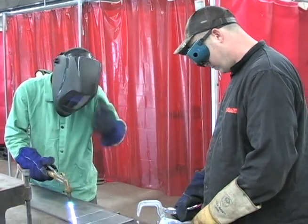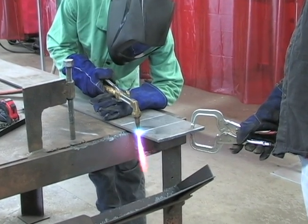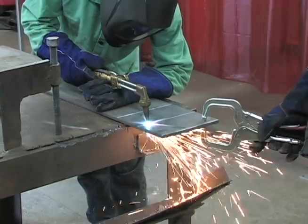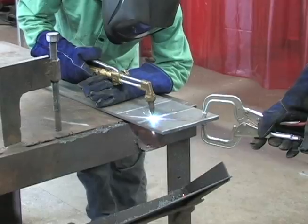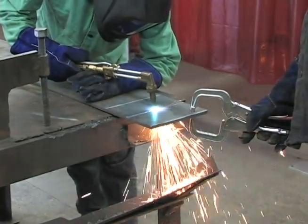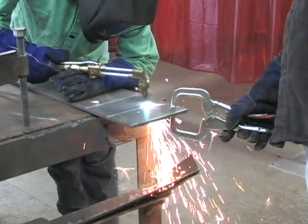Dustin Rain will be coming in and he'll be fire watching as Cephas makes his first cut. You want to make sure that you're preheating the metal before you get started, and you want to progress across the metal as smoothly as possible while maintaining an even and constant arc gap with the torch tip. The fire watch is supposed to be scanning the area where the sparks are going, to make sure that nothing's catching on fire, including the shoe tops of both himself and the person who's cutting.